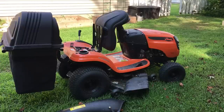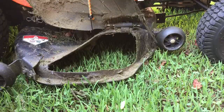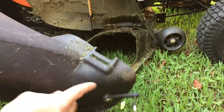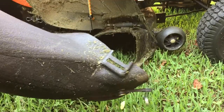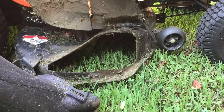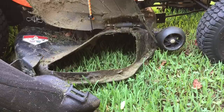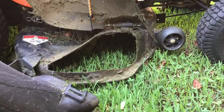Now I'll move on to showing you how to connect the grass chute to the actual catcher. I've got the lower part of the grass catcher assembly — the pipes that lead to the grass catcher body. You'll notice a notch that's cut into the lower pipe, and that notch will fit over this tab that's on your mowing deck. Now if you don't have a tab on your mowing deck, Pullen actually includes a tab for you to bolt onto your deck so you'll be able to mount this chute.